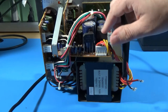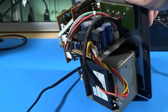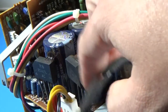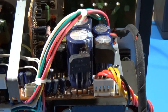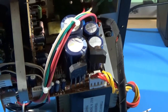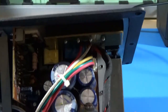This is your linear power supply section up here — you can tell because you have bridge rectifiers that will take the AC from the transformer and rectify it into DC. These large capacitors are filtering out all of that raw DC. There are two of those — a couple different rails. Looks like we have a relay down in here, an inductor, a couple more capacitors. Let me get a flashlight to make it easier.